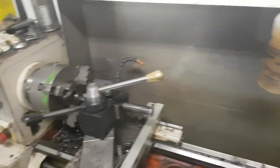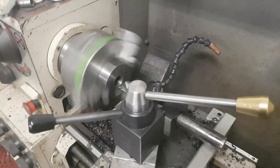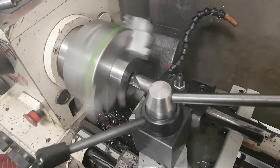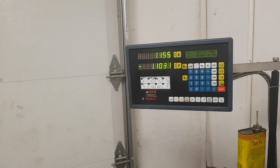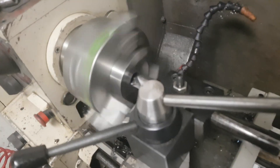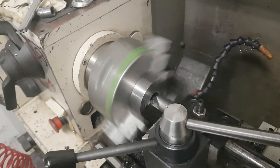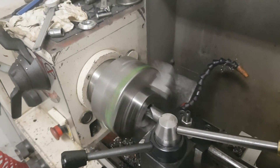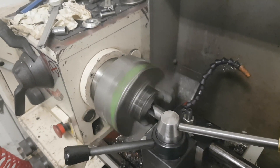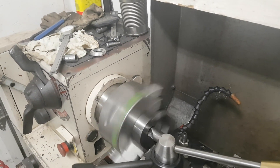Working on the quick attach project for my PC 35, working on the lathe here. Taking 75 thou per side off — 150 at a time — punching these out with the drill bit at one inch, and now I've got to get them to one and a little over three-eighths.